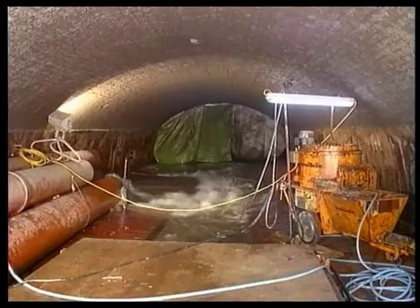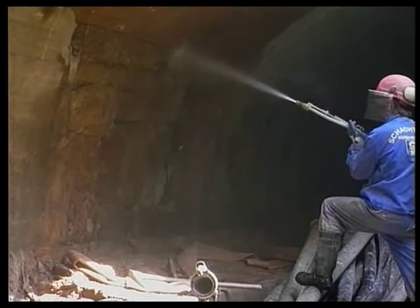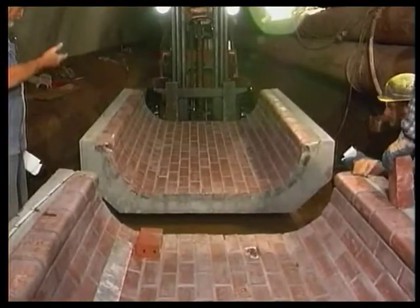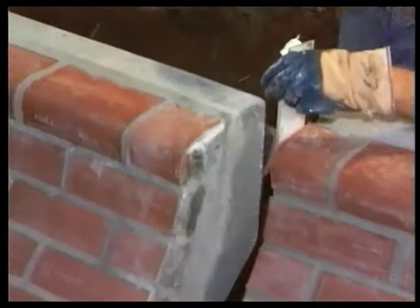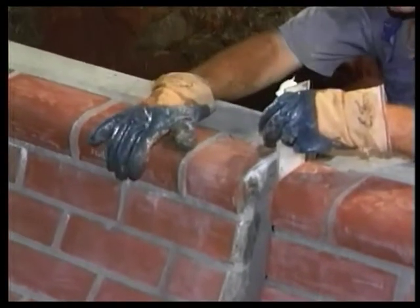And here the application stages as applied in practice. The internal brick and natural stone surfaces of the municipal sewer are cleaned by high-pressure water jetting. The precast clinker segments with Vandex bed joints are inserted and the joints are filled with joint Unimortar 1Z.